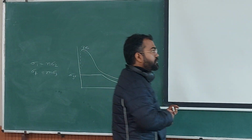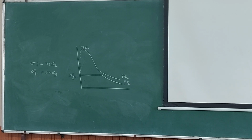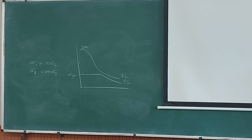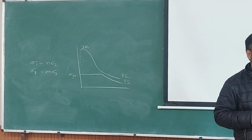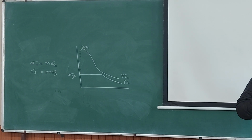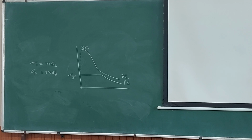Okay, so this stress defines how much hydrostatic stress there is, and those are not a function of R, so they will be there at the tip also. Okay, so if the T stress is positive, that would mean that you have a hydrostatic tensile constraint. So that means the material points are expanding. And if it is negative, then that would mean that there is a pressure which is trying to compress it.